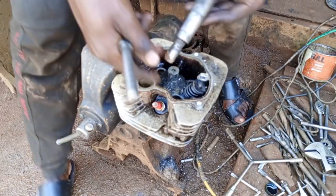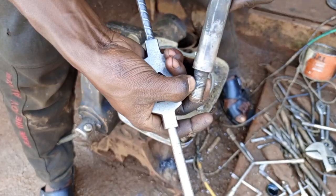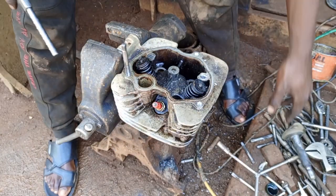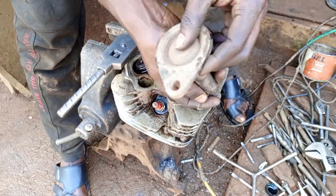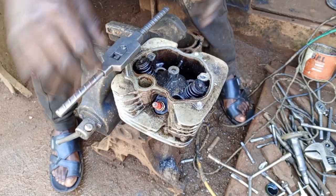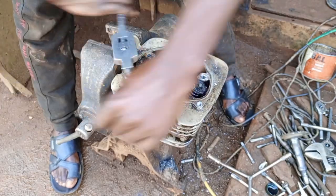We are going to thread this one too — I've got another job. Don't miss the video on how to remove this one. This is about 24 — that is, 16 millimeters — and we are going to put it to 14 millimeters, but that's going to be in the next video. So don't forget to watch it and stay tuned. This is for the coupling of a counter on a Toyota vehicle. I'll show you how to change those threads from 24 to 22, that's from 16 to 14, 1.5.